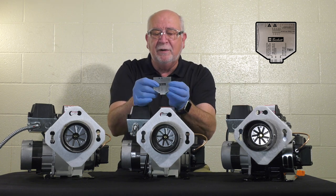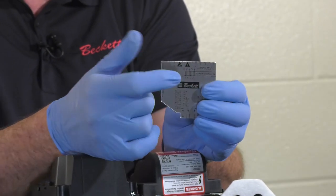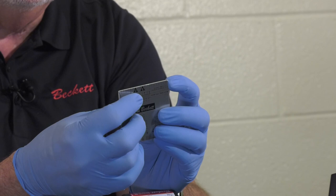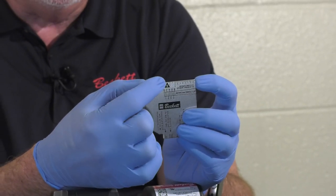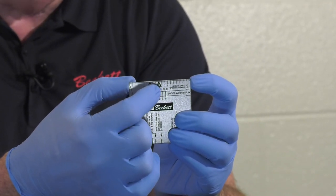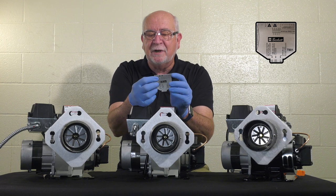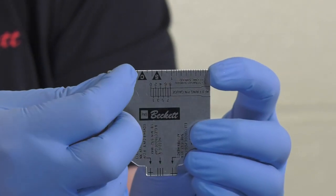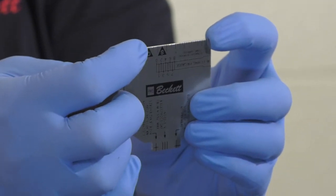Using a T501 gauge you will see two triangles up on the top. The first triangle is an inch and three-eighths away from the edge, indicated with the letter S in the middle — that is for the straight shroud. The next triangle is the C triangle at an inch and three-quarters away, which is for the conic shrouds.